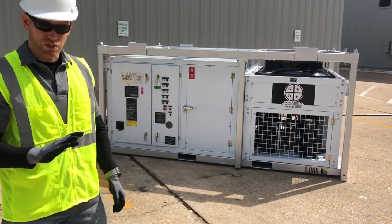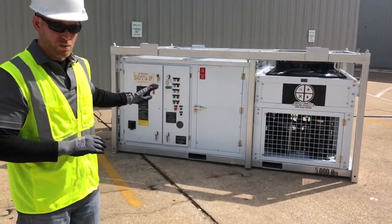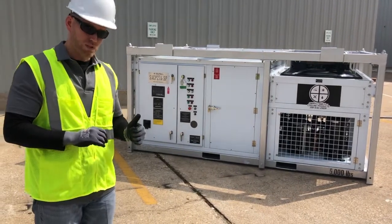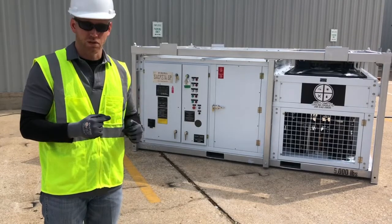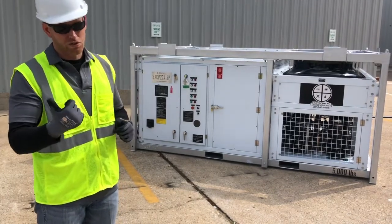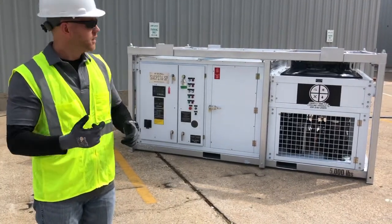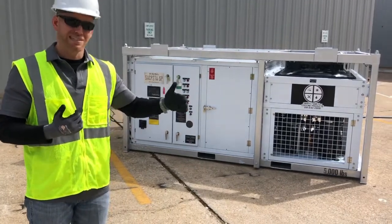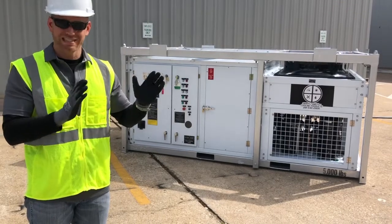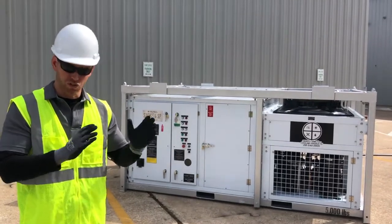The second item for safety: our unit is provided with a unit circuit breaker. However, you are responsible for upstream disconnect or electrical protection. That could be an inline distribution panel circuit breaker, it could be the circuit breaker on a generator, or it could be the circuit breaker in a customer MCC. That upstream disconnect and electrical protection is your responsibility.